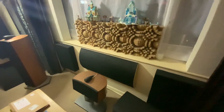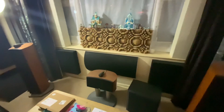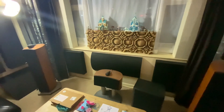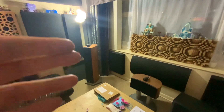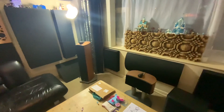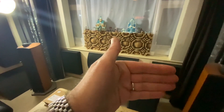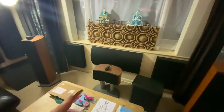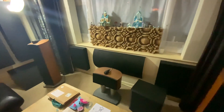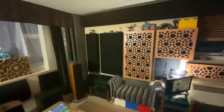That's the diffuser array. Below it there's a bass trap slash diffuser — a very basic simple poly diffuser, just a curved piece of wood with a bit of insulation material inside; it does actually absorb bass. Either side we've got two diaphragm absorbers. While the membrane traps just have a piece of vinyl or something on the front plate to be slightly diaphragmatic, these are proper diaphragm absorbers — a very rigid, very heavy, essentially airtight box where the membrane on the front moves in and out at the frequency it's tuned to. These are tuned to 70 hertz, and they're behind the main front left and right speakers.